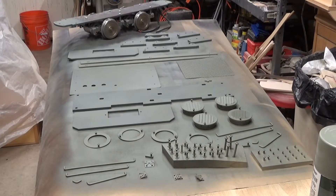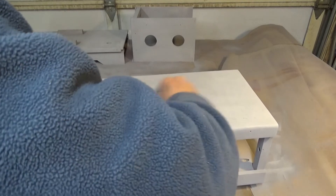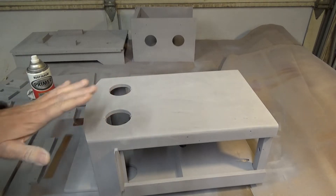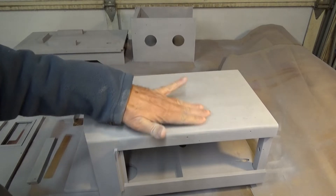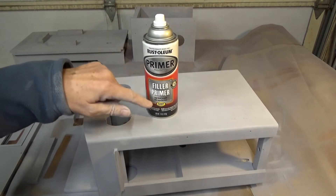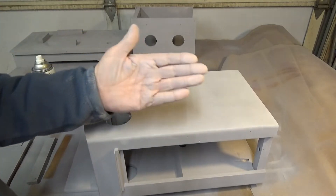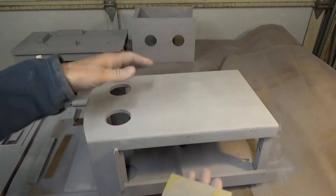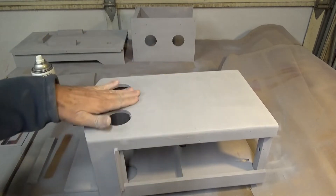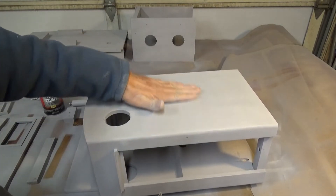There's the etching primer coat, and the sandable filling primer first coat. Before I put color on any of these wood parts, I always use a filler or sanding type of primer paint. Sometimes it's called sanding filler primer. Basically, in addition to the primer base, you get a powder particulate that can fill in the grains of the wood. That tends to minimize the grain and allows me to get a more metallic look when I apply the coat of paint. Just a couple of coats of this, work it in with some sandpaper, and you get a remarkably smooth finish for a piece of wood.